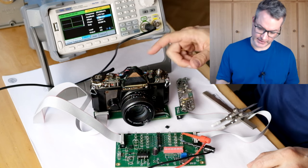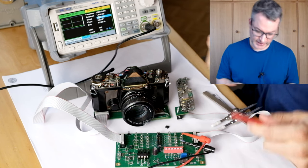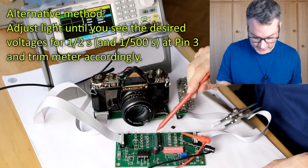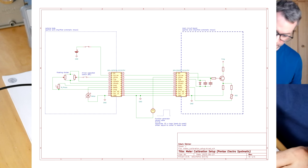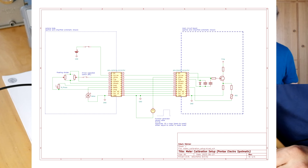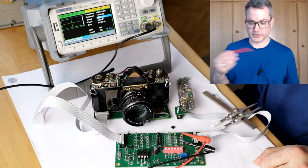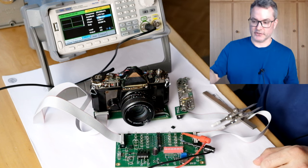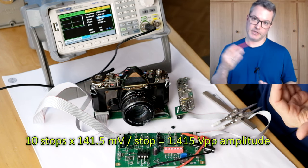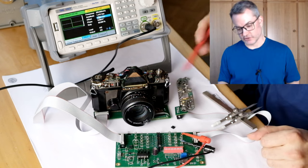Here's my setup for calibrating the meter in the viewfinder. The camera is connected to its PCB. With one exception, using this jumper, I have disconnected pin 3 from the camera body. This is to avoid any influence of the resistive dividers in the camera when we are forcing a voltage on pin 3. For forcing the voltage, I use a function generator, and it is set to generate a very slow square wave with a frequency of 0.2 Hz and an amplitude that corresponds to 10 stops difference at pin 3. And this difference of about 1.4 volts at pin 3 should make a difference of 10 stops